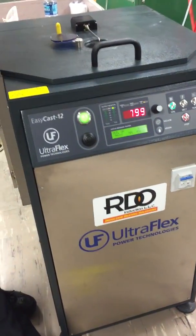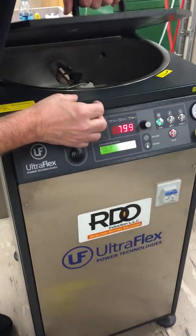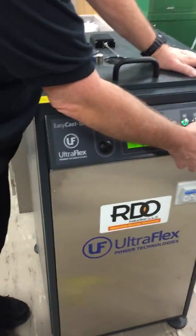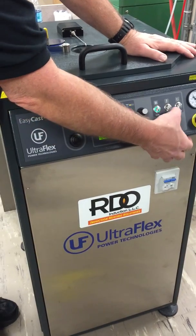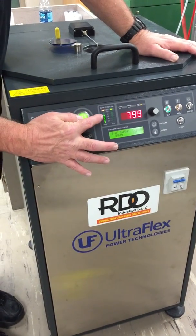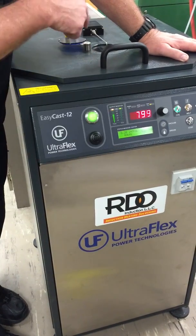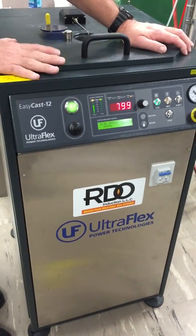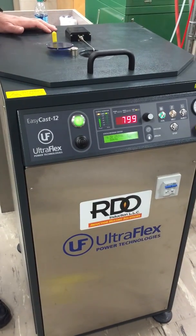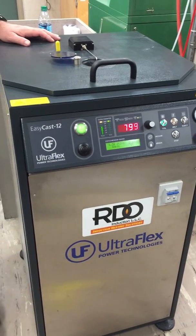So I'm gonna raise the coil. Put some protective gas. It protects my crucible as well as the metal. And start melting. And you can see that's power going to my coil. There's a safety lock. Whenever you're heating, you can't open this lid because you don't want to come in contact with that induction coil with 3 kW going through it. Because it's going to land you up over there.